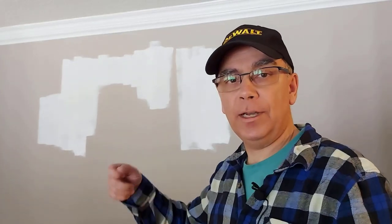On the next video we'll continue on with preparing the popcorn ceiling to be painted and maybe some painting of the popcorn ceiling. Also I want to add: when you do drywall repairs — fix holes or do a repair like I did in that hallway wall — you have to put primer on top of that drywall compound after you're all done sanding. It has to be treated with primer. If you paint over it without priming, you're always going to see it. The prep work you put in before the actual painting will pay off at the end. If you don't do your prep work properly, you're going to see blemishes in your walls and you won't be happy with it. Go around and fix anything — holes, bubbling paint — fix everything first, and allow time for all that prep because that's the most important step. It's the foundation of doing a good paint job.